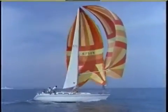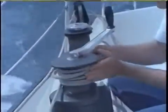Once the new sail is up and full, the after guy is eased so that the old tack can be tripped out of the shackle. The guy is eased further so that the foredeck man can pull it down to the new sail.